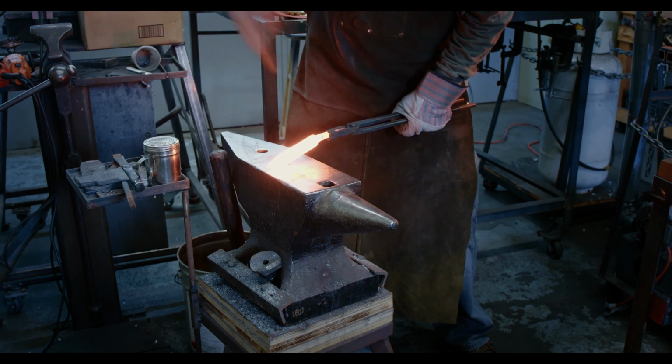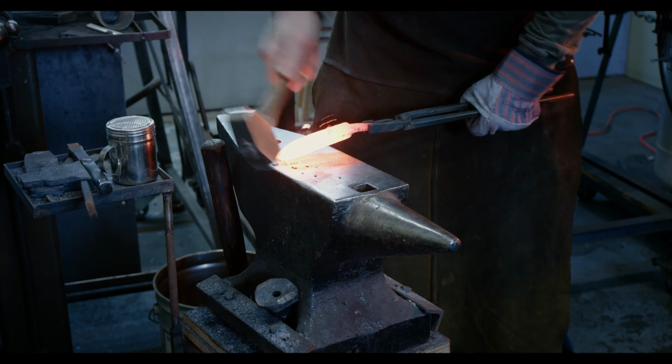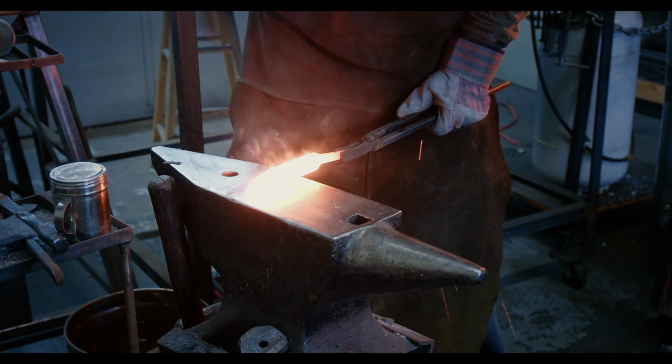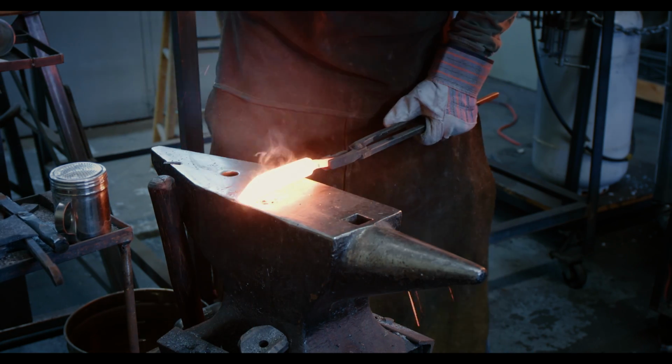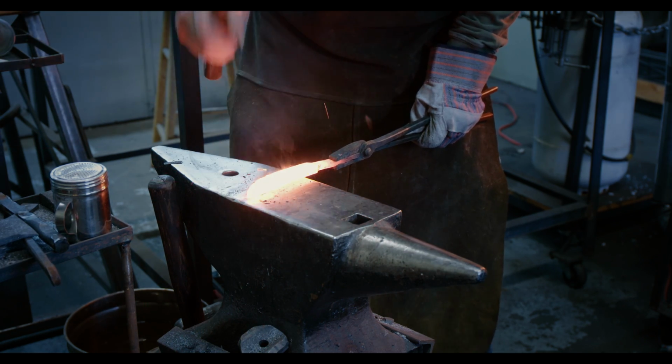The reverse tip needs to be forged back so that the cutting edge curves into the back of the knife. The pattern will follow the same curve. At this point, weak welds have a tendency to open up. Fortunately, everything seems to be solid and holding up here.